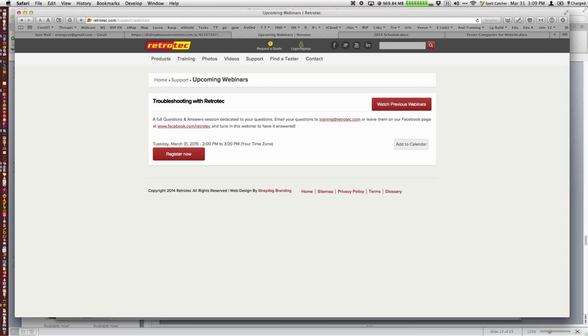If you have an intermittent odor problem, a blower door is a fantastic tool, not for measurement, but to recreate the smell. So that could be a funky drain or a funky rodent that kind of comes and goes depending on the wind or the direction of the wind. So that's a great tip. Thanks so much.